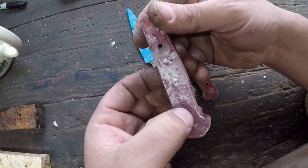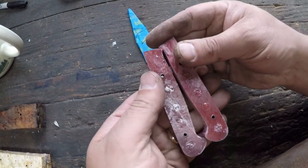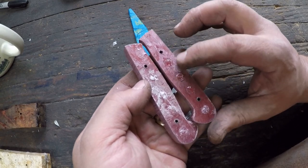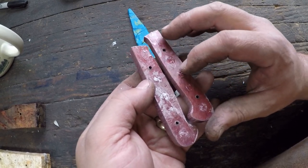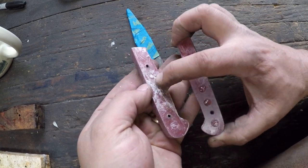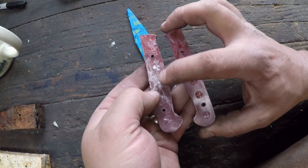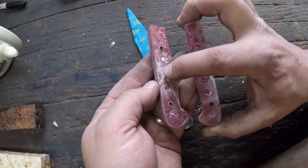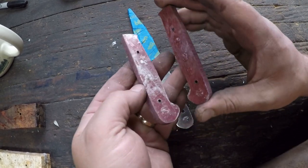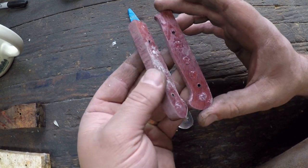And then grabbed a hold of the other side, okay? You can see that the amount of epoxy, even though this side right here wasn't showing very much gap at all, it still got a good coating of epoxy in it. This side right here that had too much gap, you can see it's got more epoxy in there. And you can also see where that epoxy was starting to set up before the pressure got applied, all right? Which is why, you know, this is a fail. Okay.